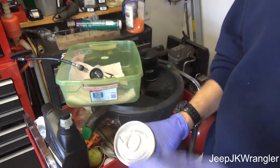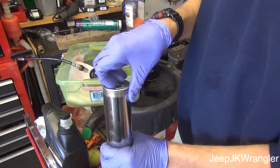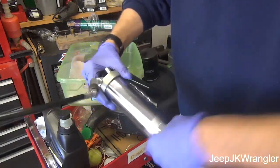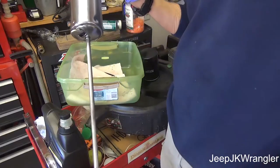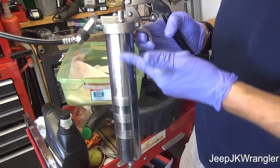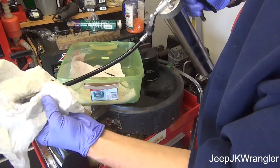Now, this is what you don't want to do: do not pull this and let the handle go, or you will have 14 ounces of grease either in your face, on your clothes, or whatever. So we pop the top off — the grease is in there just like that. Take the top assembly and screw this back on, just like that. Notice this is still in the ready position, and then you just pull it and let the spring go. It's putting the tube of grease under pressure; squeeze the trigger to work the air out and you'll see grease dispense. It's just that easy.